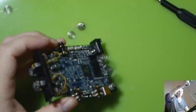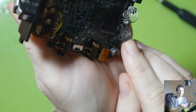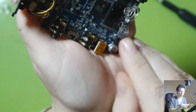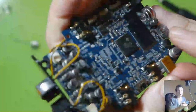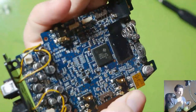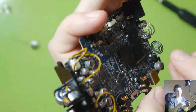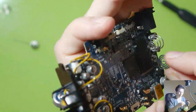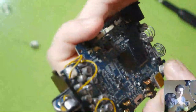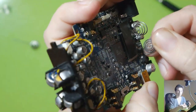Alright, let's see how good you can see here. So this one here is the very, very poor one. It got very black. It's black all the way through to the other side. I did reflow the solder, so I got it working again. And I cleaned off all the corrosion, first using some vinegar, and that was really cool because the vinegar reacts with the alkaline acid from the batteries and it makes bubbles. And then I cleaned that off with isopropyl alcohol. And to get this working again, I had to actually file back the outer coating so that I could see silver again.